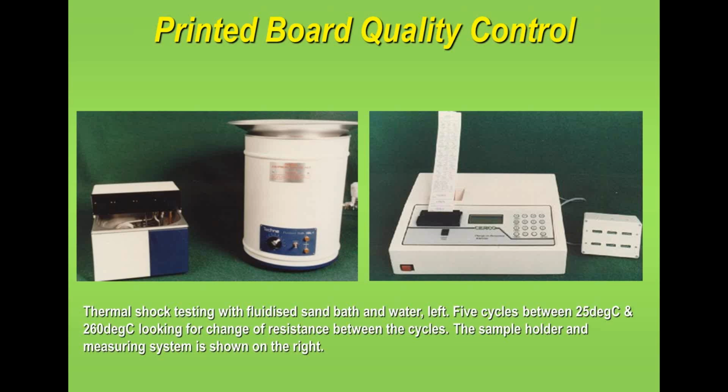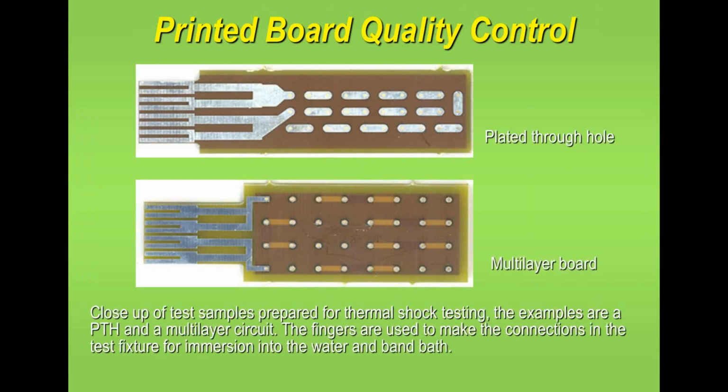And this shows up quality of copper plating and also ductility of the copper plating. Again, it's an old test, still quite a test that's performed for high-end, high reliability printed circuit boards within industry. These are the two test patterns, and basically it's just looking for resistance change between the two tracks within the sample. So you're going through the plated through hole on a number of occasions and then measuring the result. There are similar tests which are also conducted in high-end printed circuit boards in an automated method, which we don't have time to go into in this webinar this afternoon.